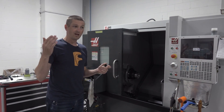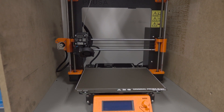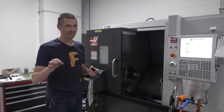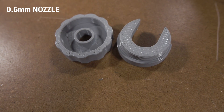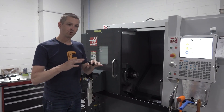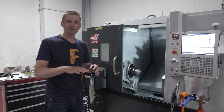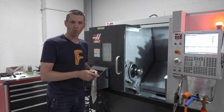If you're new to 3D printing, two things you may have heard are that it's either expensive or takes a long time. We've had a number of different 3D printers — the one we're using now is a Prusa, it's a thousand dollars, absolutely a great printer especially for that price. They come standard with a 0.4mm nozzle, great for fine detailed things like threads. If you want to rough things out and print quickly, upgrading to a 0.6, 0.8, or even 1mm nozzle gives rougher-looking prints but much faster. We've compromised on a 0.6 right now — a good balance of speed and enough resolution to be useful.